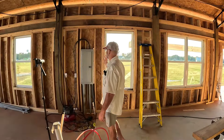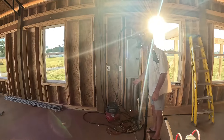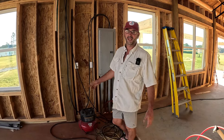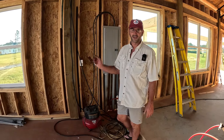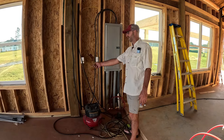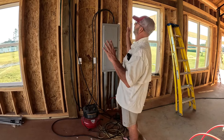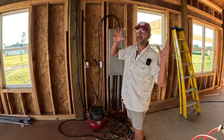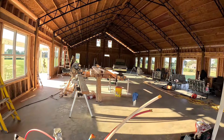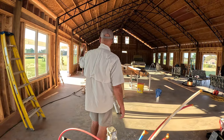We got it done - it's all finished. We finished the electric, got the wires all in, the lights in, a couple of receptacles. Still have the ground to do - I'll strip it and tape it green. Two ground rods needed: I pounded one today but it was extremely hot and the ground is like concrete, so I got one in. I'll do the other one in the evening when I have a little more energy to drive a 10-foot ground rod in. It's grounded back to the main panel so it's fine. We're good - tonight when we get home we'll turn these lights on. If you look around, we've got windows in this place. I was kind of under the gun, so I didn't tape all of the installation.